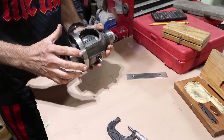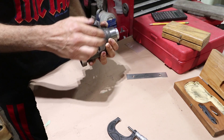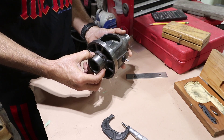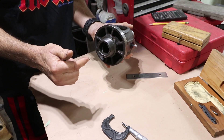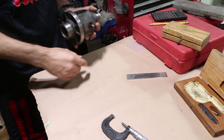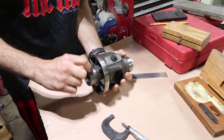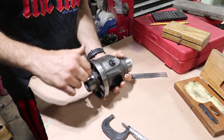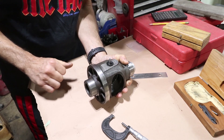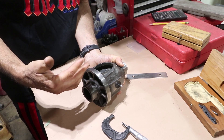Now everything is assembled and machined, ready to go. But I need to calibrate the location of this pointer relative to this machined surface — I precision ground that surface with a flat honing stone. I've taken careful measurements of the two outer diameters that support the bearing, divided by two, and established that the centerline of this carrier to this machined surface is a known amount. It's 2.8065 inches, and I verified that surface is flat to within a thousandth of an inch in both X and Y.